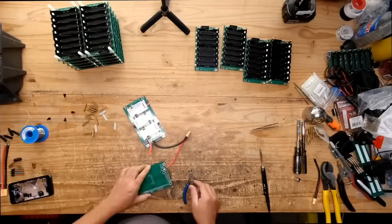To 100%, and then we'll discharge it and see if we can get more than 1 kilowatt hour off of this, because the BMS might be smart enough to not let that happen. It might say, hey, I know I have this amount of battery, but there's more. There's a problem because there's more. Hopefully not. All right, so here's the real test. This is 100% charged. I'm discharging it at a rate of 1,000 watts or 932 watts. It's supposed to only last about an hour, because remember, as our test showed, it only has 1 kilowatt hour.